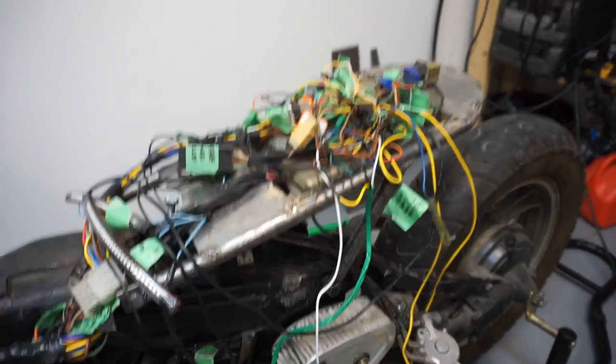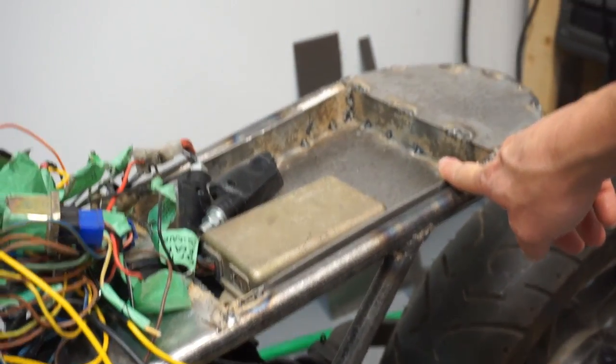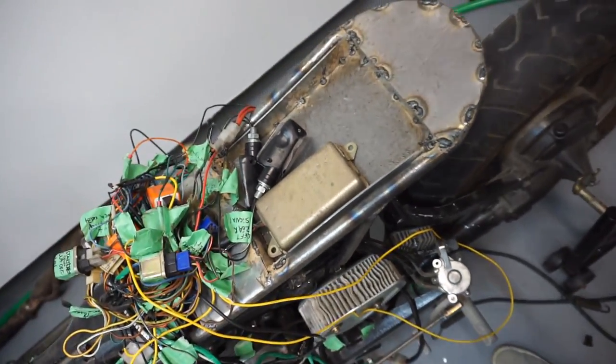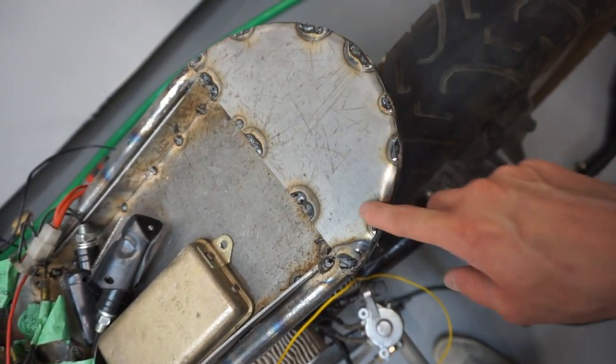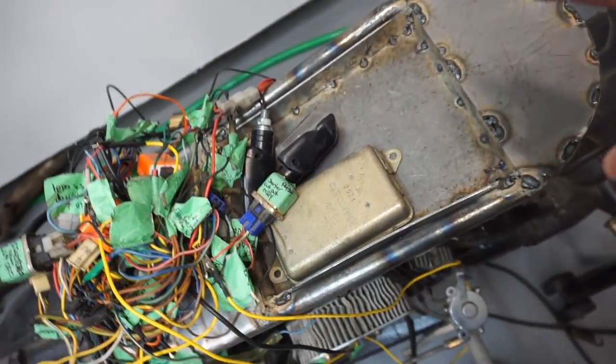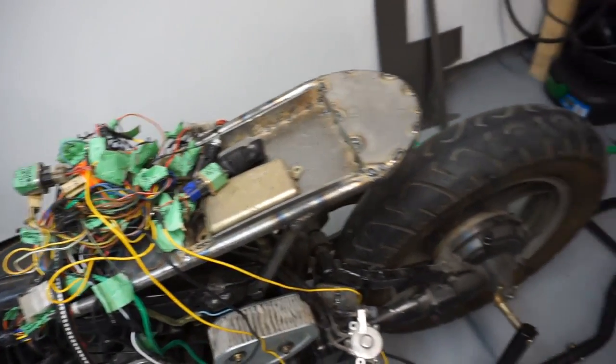It's pretty simple. After that I'm going to start working on the exhaust. I've already removed the exhaust — I didn't make a video for that because it's pretty easy and straightforward. I did have to chop it up to get it out because there's just no other way, at least with the tools and lift I have. So here's the subframe seat pan tray. All I did was grab some flat steel, tack welded it in place in case I need to make changes, and measured up to the subframe itself. This sheet metal is just tacked on for now — same thing on the front — and it should hold all my wiring and stuff. It's four pieces with sheet metal on each side just to cover it up.